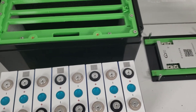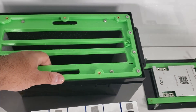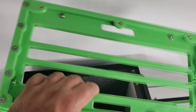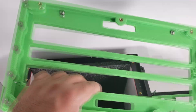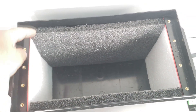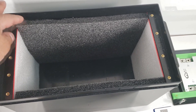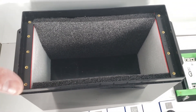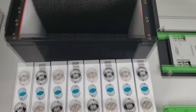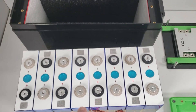Then you'll take the lid off, and just like the 4S kit, you'll take the brackets off and then put this bracket on. This is a special bracket — it is designed for the 8S. As you can see, it's a double-layer bracket, very heavy duty. Overkill for this, but that's what we like. It should keep the cells in place. You'll notice we have two white foams on the side and two black foams on the alternating sides. This foam is about three-quarter inches and this foam is about 20 millimeters, so it's going to provide the compression and secure placement that we want. We're just going to pick this up, insert it right in there, and it's going to be a nice snug fit. Then we'll start bolting down our battery terminals and bus bars for this setup.